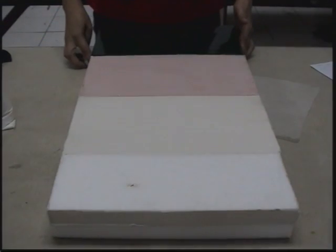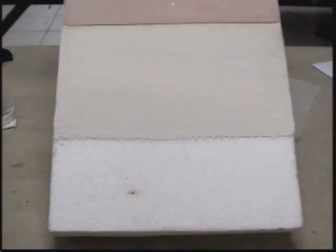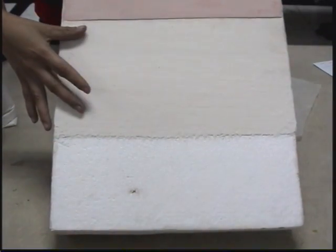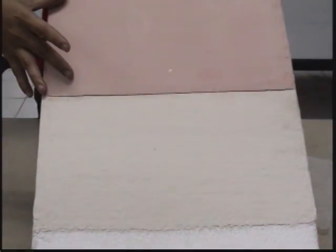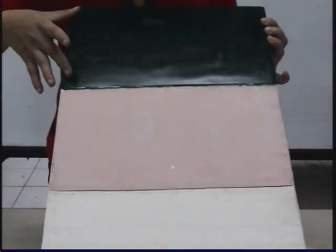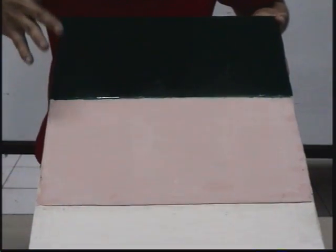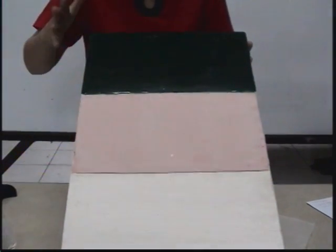The more exciting use of Styrskine is to make a fiberglass plug or pattern. Here's how we do it. This is an ordinary styrofoam core with three layers of Styrskine with surfacing mat. Notice the surface is not yet sanded because we're going to apply Polypads — a very economical, high quality, and cost-effective body filler. The last layer we applied is CR 10690 tooling gel coat. You can see that from ordinary styrofoam, we now have a very smooth and high-gloss plug of our pattern using all the materials mentioned.